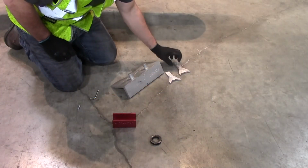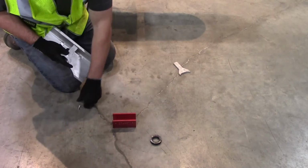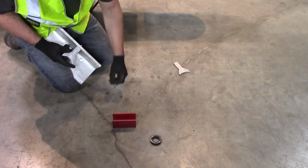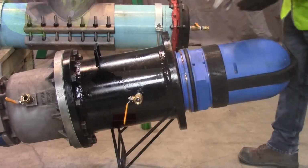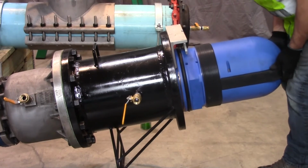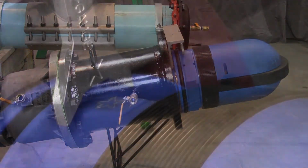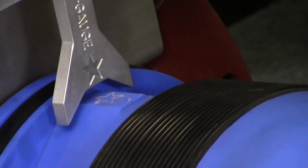Set up the Insta-Valve 250 10 through 12 inch alignment gauge for the size being installed. Refer to the alignment gauge instructions shipped with the 10 through 12 inch Insta-Valve 250 alignment gauge kits. Set the curved portion of the alignment gauge within the lock pin groove of the valve cartridge. Slide the valve cartridge and alignment gauge towards the insertion housing until the alignment gauge touches the insertion housing. Ensure the flat of the alignment gauge arm remains aligned with the truncated side of the valve cartridge.